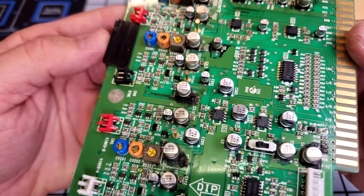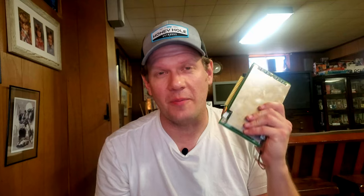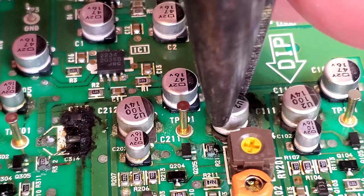We're going to do what they say should not be done, and that is to remove SMD capacitors from a Sony BVM card using pliers. We're going to twist and pull off SMD capacitors that are bad inside a Sony BVM video card. Hopefully nothing will be damaged, but that is always a risk — if you try this there is a chance you will damage your board, pull up a trace or a pad, and have a lot more repair work on your hands.